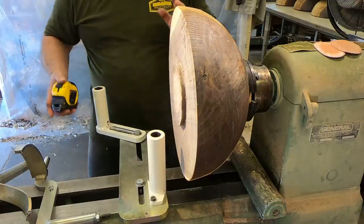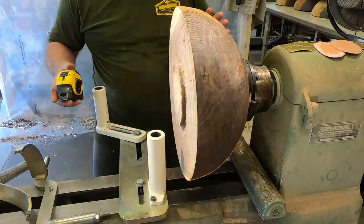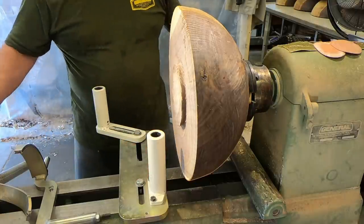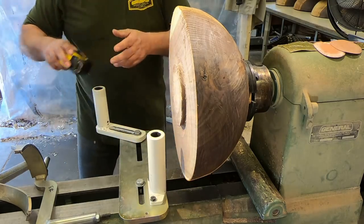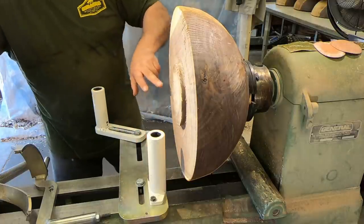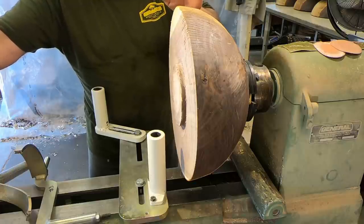Okay, so I'm just gonna briefly explain this system. Again, it's all explained on the huge maple burl and cherry crotch coring video, so check that out. But essentially, I have a 20-inch lathe. This is the base that goes along with the One Way coring system. And so this bowl here is 15 inches. Now, if this was, say, a 19-inch bowl blank, I would use my number 4 to set the rig, because that will give me the biggest bowl on the biggest core. So this is a smaller bowl, so that means I'll use my number 3.